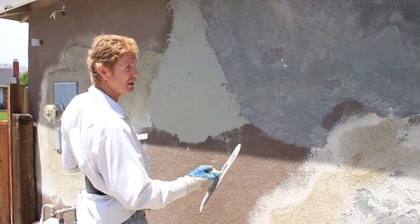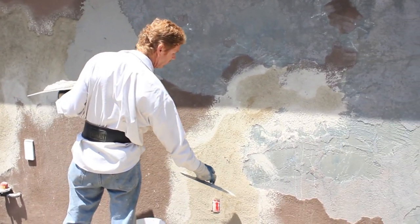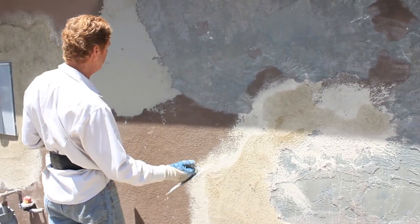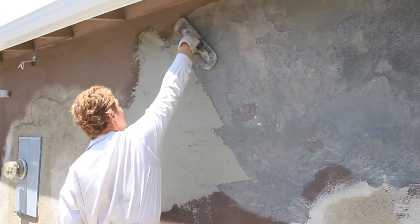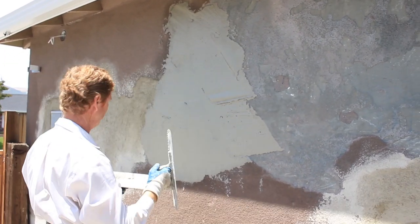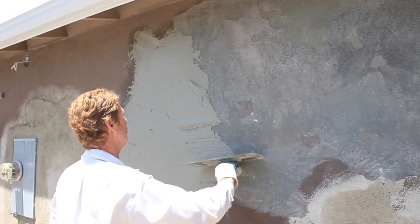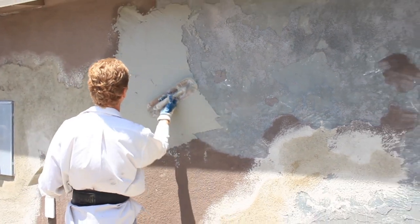We've got a lot of things going on with this wall. In some areas where it came off and it's three-eighths of an inch thick, I went ahead and spread it with cement. I'm just spreading this with color coat. This is 2030 and this is 1620 — all I'm doing is filling it up to get it to the correct thickness. By the time this dries, I'm going to hit it with the proper grit. I'll take the whole wall and then show you the final coat.